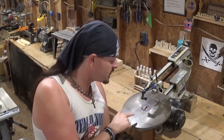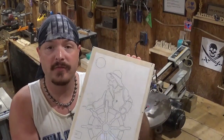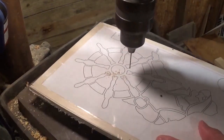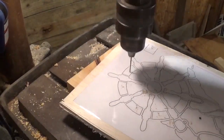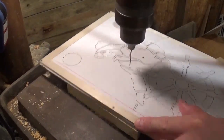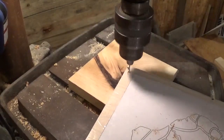When stack cutting, make sure that your blade is lined up to your table at a perfect 90 degrees. I've already got the pattern attached with clear packing tape, so let's head over to the drill press and drill a bunch of pilot holes to get started. Over here at the drill press we're going to drill all of the pilot holes for all the interior cuts — I believe there are between 35 and 40 interior cuts on this project.